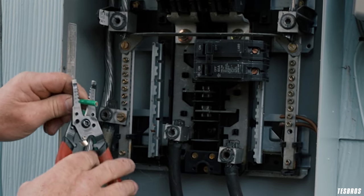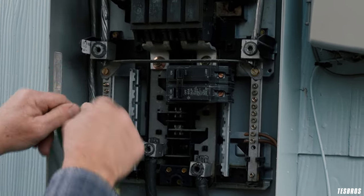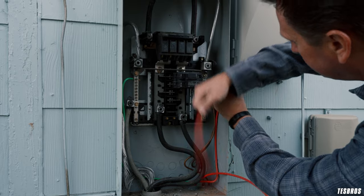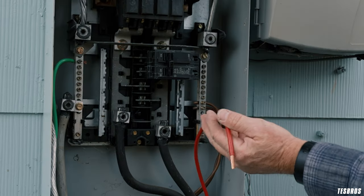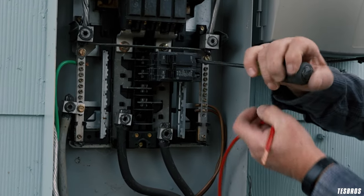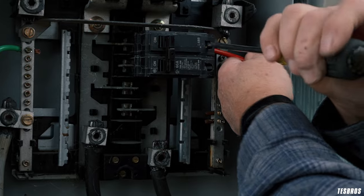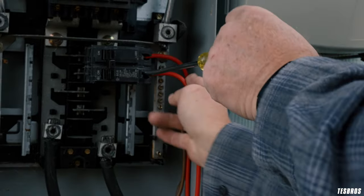Having a wire cutter is really important so you get a clean cut. Use a screwdriver to loosen the terminal first, then connect and tighten the ground wire first. For the hot wires — you have two reds — measure each one, use your thumb as a guide, cut, then strip the wire. Loosen the terminal, and the wire will slot right in. Once seated, tighten it down very firmly — you want very hard, solid contact. Do this for both hot wires. Always remember: never work on live electricity — the breaker must be off.